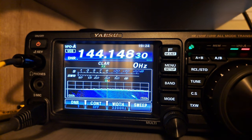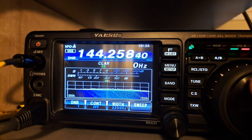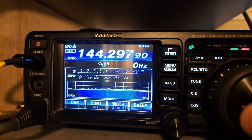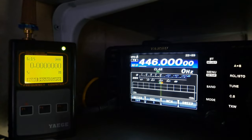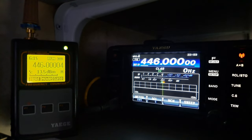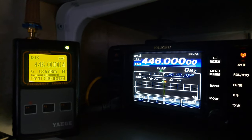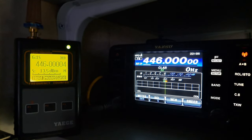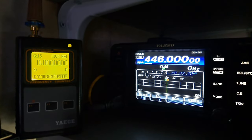He said: 'Hey, you're slightly off the frequency.' Quite an interesting moment, because the frequency on my display was correct. Has the frequency really deviated? Well, it's easy to check. Let's push the PTT and... yes, on 70cm we have an offset of 40Hz. Previously I checked the 2-meter band and the offset was about 20Hz. It's okay — reference frequency going through the complex mathematics inside of the transceiver.